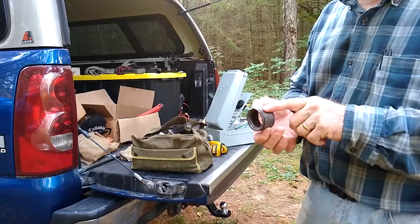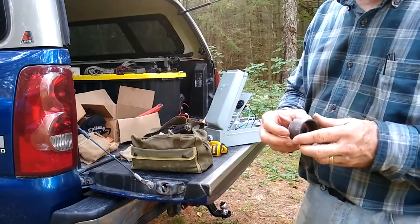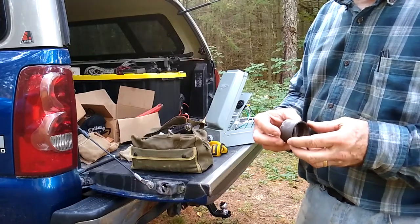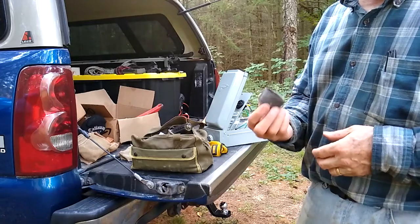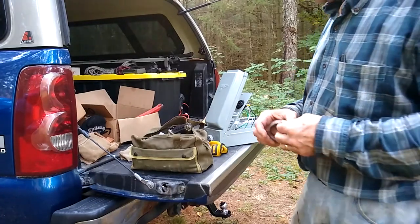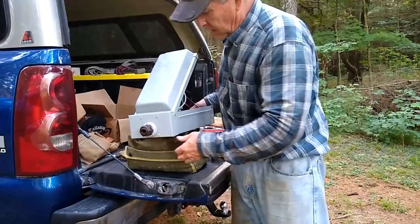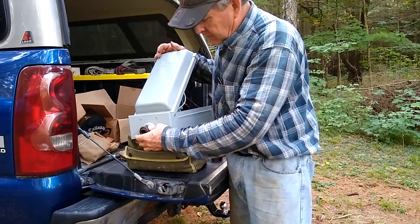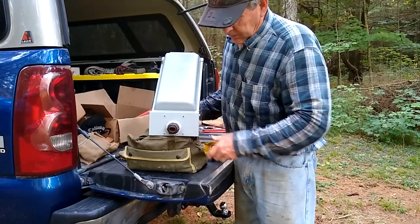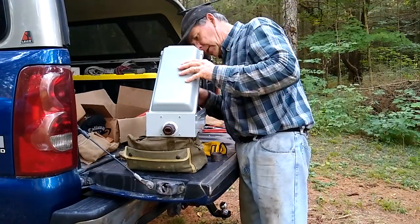That's a sleeve that I believe screws into the bigger sleeve, 1.5 inch. And I did everything possible: heat, PB Blaster, monkey wrenches. Could not get that apart in order to utilize this old piece. But I did go to the hardware store and find some other pieces that I could modify to basically utilize the old clamp assembly, waterproof, for the wire coming down from the top of the pole. So that's all set, ready to go.